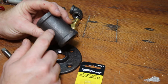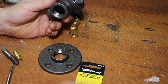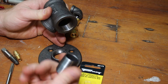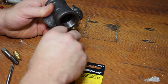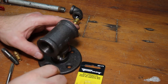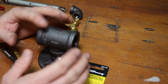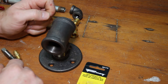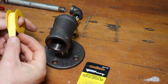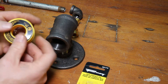To make sure the hole you drill and tap is completely centered so the MIG contact tip pushes propane directly into the center of the tube, Frosty recommends getting a flange and a close nipple and setting it up so that when you put it on the drill press, you have a way to keep it completely square. That way it won't be off left or right, and you can drill and tap exactly in the center. One last thing: you'll need propane-rated tape to lubricate the threads a little bit when putting the pieces together — it's rated for propane use.